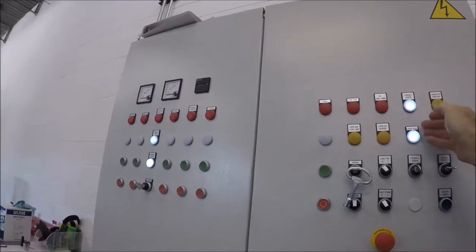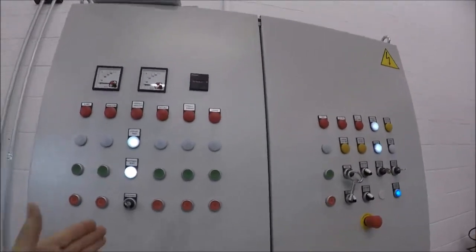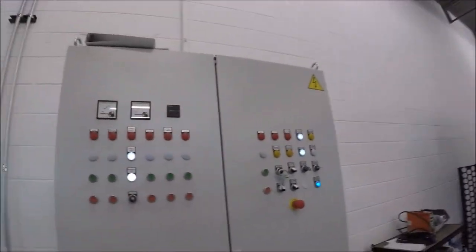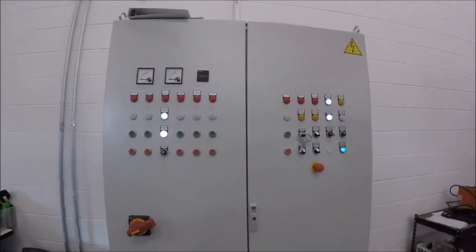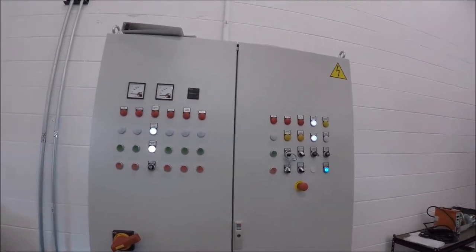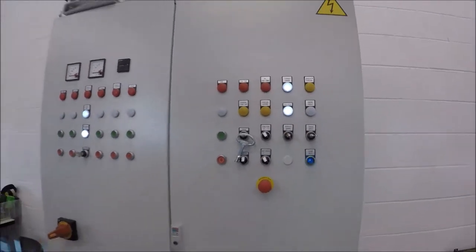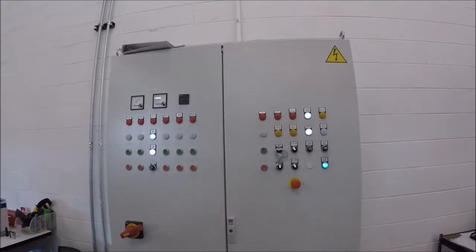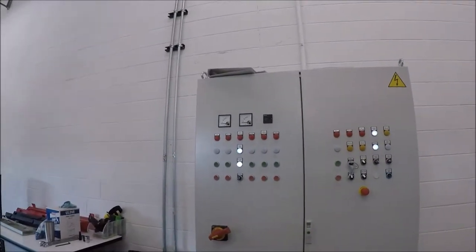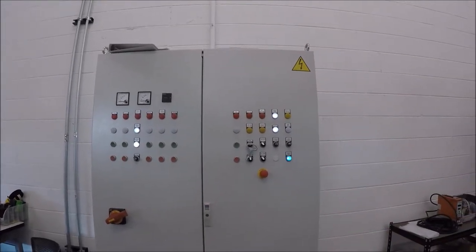The blue button — having these buttons lit means it's ready to be in maintenance mode. If you don't have it in maintenance mode, the safeties on the machine will remain locked and you won't be able to enter the machine. The ability to bring down the shredder screen will remain in a locked position. So you need to set the main control panel to maintenance mode, have the hydraulics ready, and then have the screen ready on the hydraulics.